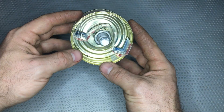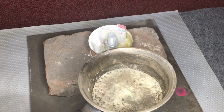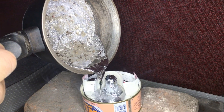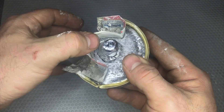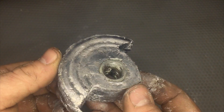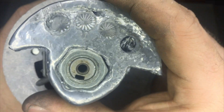I put some cement inside behind the stopper and push it with my fingers — this will stop the mold. Now I've melted in the kitchen almost one kilo of lead and I put it inside the mold. I wait about 20 or 30 minutes for the mold to get colder, then I take away all the things I put inside. So let's take away the stopper and also the big screw on the bottom. The mold is free and I'm quite happy with the result — it looks almost like the small motor I showed you earlier. I can put it on top of the shaft and make sure to stop it with a big screw so it doesn't fly away.